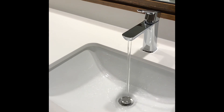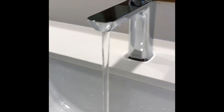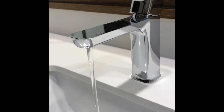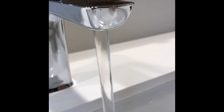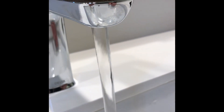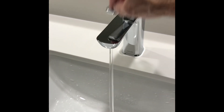Okay, turn the water back on. No flow restrictor — this is what we have. I like that a whole lot better. The 0.5 gallon per minute flow restrictor is gone. This also has an aerator that may be restricting some, but I think it's better. It's a little bit better.